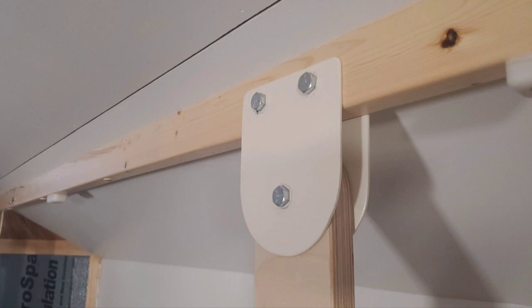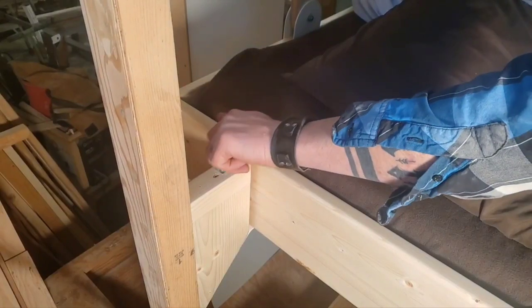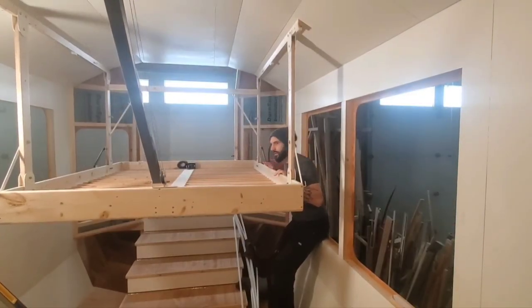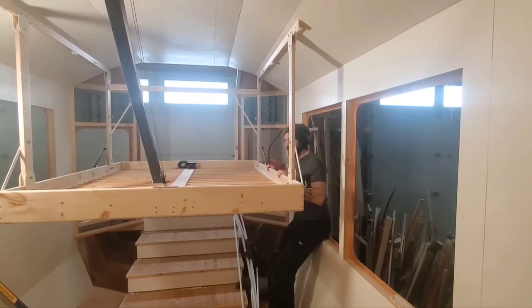That being said though, I couldn't tighten those bolts all the way, otherwise the frictional forces would overcome the forces needed to move the bed, so there is some wiggle room in the setup. But the second I lock the latches at the front, everything becomes very stable, and even though it's not their main purpose, they do prevent lateral movement as well. Well, the bottom line is the bed is not going to swing uncontrolled from the left to the right as soon as the boat is under a little movement. It's fairly secure in place, and I hope that answers the question.